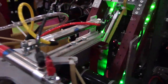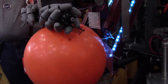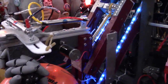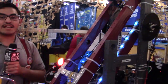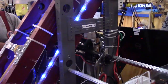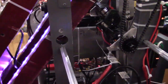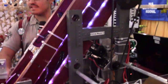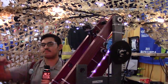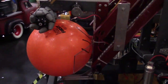I want to hear more about this four bar mechanism and any other components on the robot. So we decided to go with a four bar this year. Last year for Power Up we ran an elevator, and we decided why not try something new — that's where the four bar came in. It helps keep the intake system parallel when we're scoring, such as when we're up there trying to score level three hatch panels on the rocket or level two cargo on the rocket.